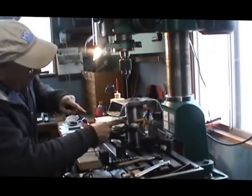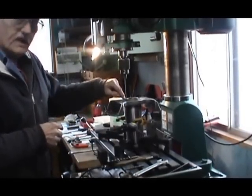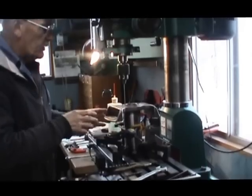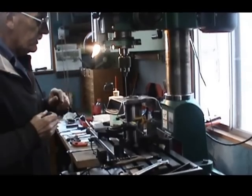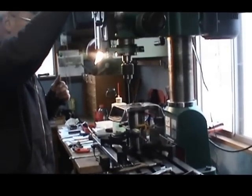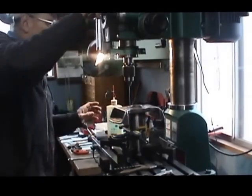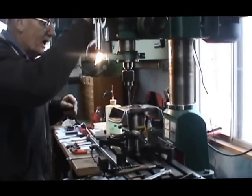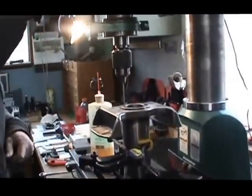And then I'm going to drill a radial hole in to intersect that. After we put the grease fitting into this section, it's going to allow us to grease the bearing in two locations. One's going to be on this fitting, and the other one is going to be on the clutch pulley itself. So what we're doing right now is just working our way down with this small hole. I've already got this piloted down in there quite a ways. I just switched over from the small drills to the extended length drills.